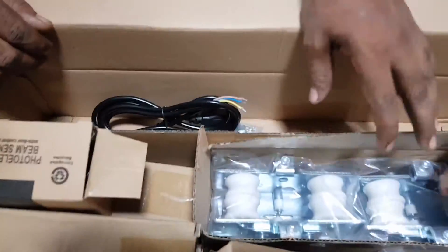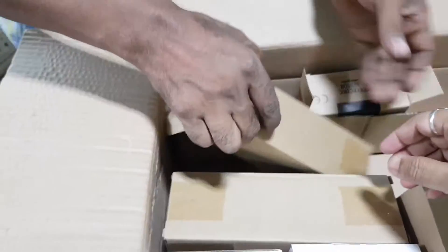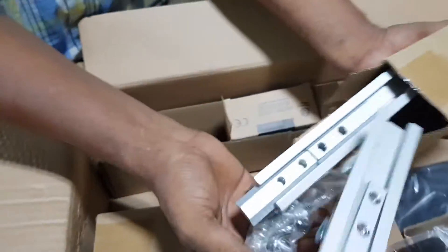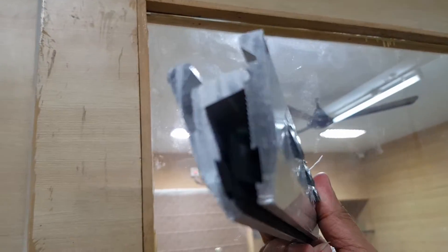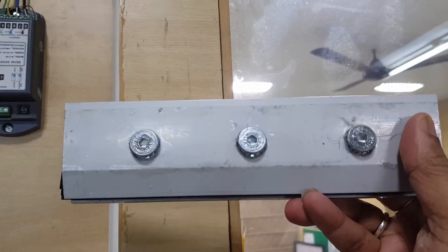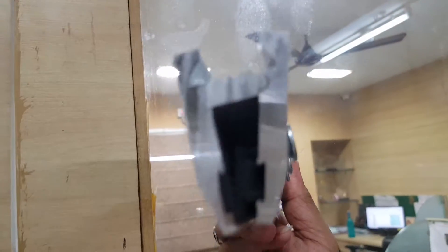These are the door hangers — there are four door hangers in total. You will also get glass clamps. The glass clamps fit below the door hangers. The glass sits inside the clamps; there are three holes but you don't have to make any holes in the actual glass — just tighten the screws and the clamps will hold the 12mm toughened glass securely.